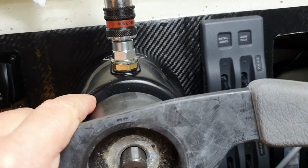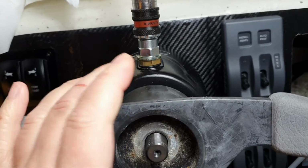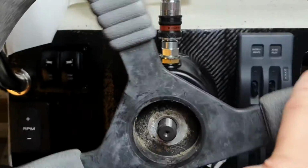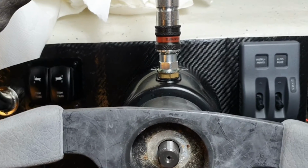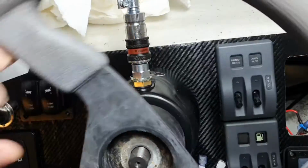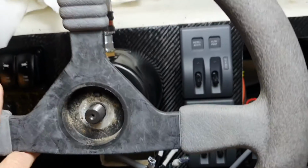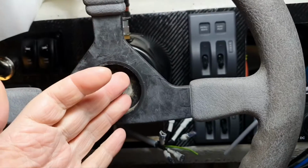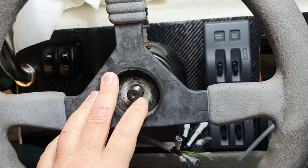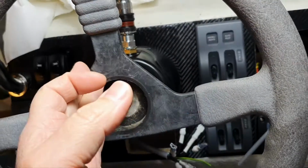So you can read on the pump, it's written 18 cc/rev. Rev means revolution. So the pump moves 18 cubic centimeters per one full revolution. Where does it move it? There in the cylinder or ram, and the cylinder is 101 cubic centimeters. So when we are in the lock position, how much liquid do we need to move to be in the other position? 101, according to the cylinder volume. And how many turns do we have to make when we move 18 every time? 101 divided by 18. So here we have this 5.4.